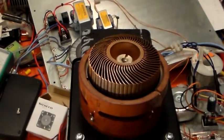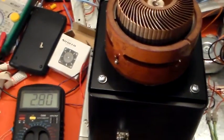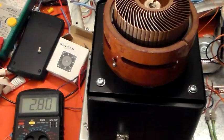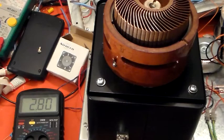I've got the heaters on at the moment. I've measured the voltage — it's about 12.8 volts. And you can see a meter there showing 2.79, 2.8 — that's the heater current. So the voltage on the heater is spot on. Looking at the specifications for this tube, it's 2.95 amps plus or minus 0.3, so that's 2.65 to 3.25. So 2.8 is right in the sweet spot.